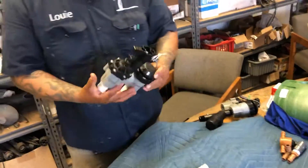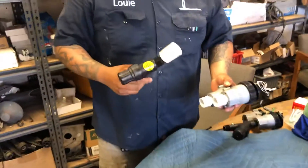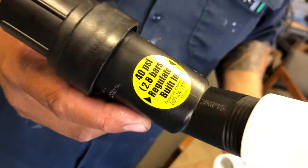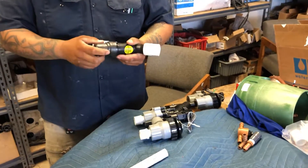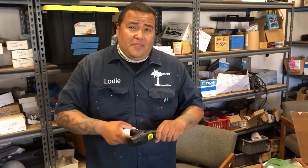An upsize from that is your regular Rainbird irrigation valve. It's not a low flow valve, and it gets connected into this particular filter here. This filter has a yellow sticker and it reduces pressure down to 40 PSI. It has a pressure regulator as well as a screen filter for cleaning purposes. The different size filter indicates different flow — this valve is capable of handling anywhere from three gallons per minute all the way up to 15 gallons per minute.